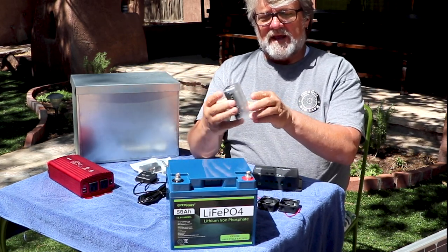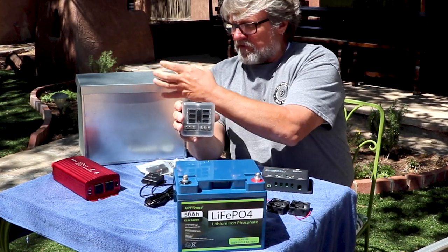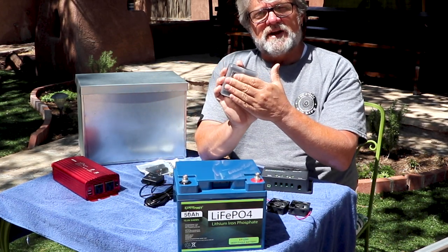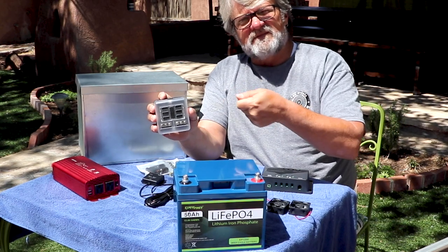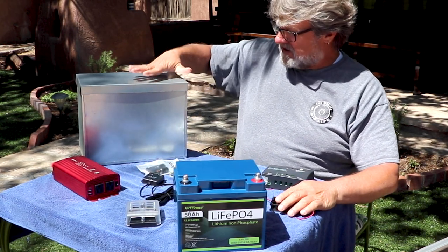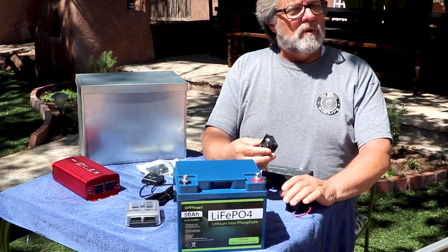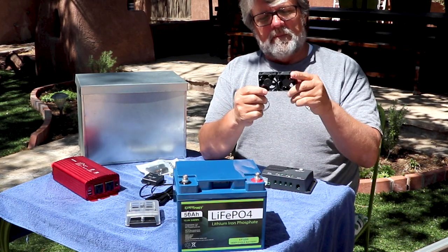I also decided to put in a junction box — a 12-volt junction — so I can run some other accessories. I haven't decided what all I'm going to put in or whether there's going to be an outlet panel on there. But I wanted a fuse block so I can have 12-volt supply and run a USB charger or maybe a cigarette-type lighter controller. Also, since this box is going to be sitting in the sun — you can tell it's warm right now — it's going to get hot inside. So I ordered some small axial fans, little two-inch axial fans, they came as a pair, and they're 12-volt.